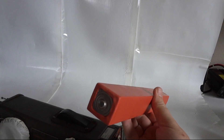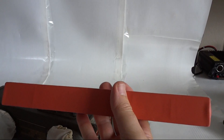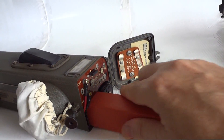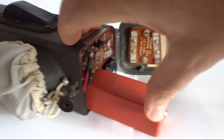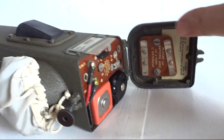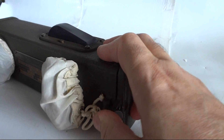The HT battery is actually rechargeable — it's a nickel metal hydride battery that gives about 100 to 110 volts depending on charge condition. This one is fully charged right now. That goes into the HT compartment. You have to be careful because if you touch the plus terminal, you can actually get shocked — so we should not do that. Looks like everything is in there.